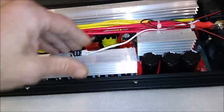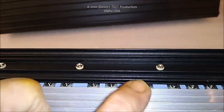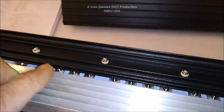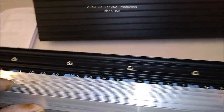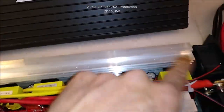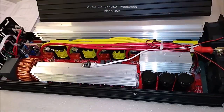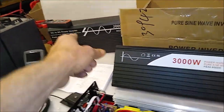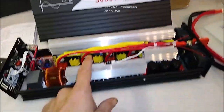Get over here on the DC side - you can see they've got doubles. Look: doubles, doubles, not singles - doubles for every stage. Instead of depending on one MOSFET, they've got doubles on every one. And there's a big, beefy heat sink. That is real good quality. We've had about a 200% increase in improvement and this is going to have to be a lot better.